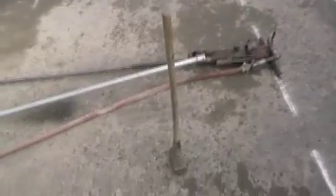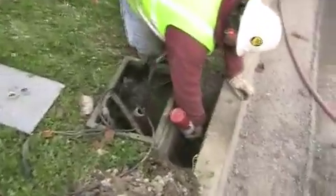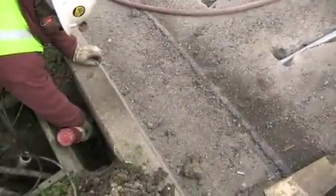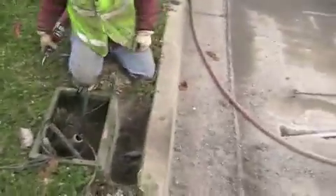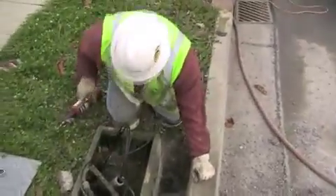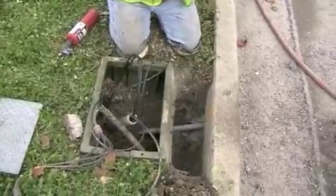There's a sledgehammer they're going to hit away on the pipe to install it. Right now I'll let the contractor explain what he's doing with the butane torch on the side of the PVC pull box. He's using it to make the plastic soft so you just let the bullet go right through it, then it heats up and pulls right back around.